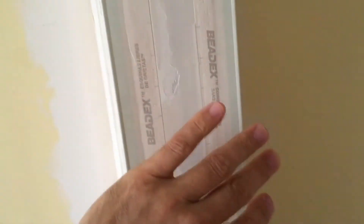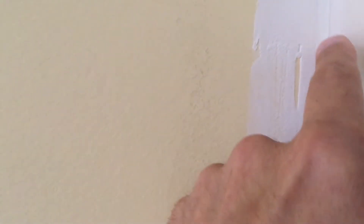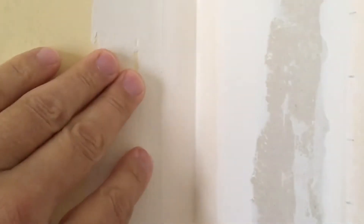What I like to do is put this on first and let it dry. Don't put it on too thick because if you put it on too thick, you'll end up putting it on, sanding, putting it on, sanding. I like gradually building it up until I get to the final skim coat — three applications: first like this, second I put it thicker, using the all-purpose or taping compound, which is a lot stronger. Like the taping compound, you barely make a fingernail mark when you push in on it. But if you use a finishing one, it's so soft it'll dent very easily. So I like only using that for the third coat, then I sand it.